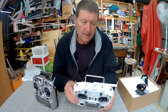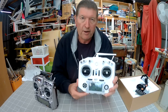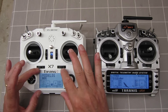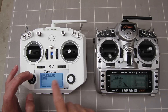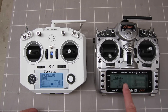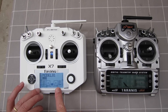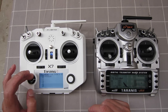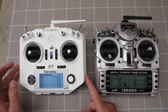You can record your own voice commands and put them on the SD card and assign them to different functions — it's just a ridiculously programmable and versatile radio. Further comparing the two: the Taranis QX7 has a smaller screen but slightly taller than the Taranis Plus, and the font is bigger on the QX7 — they use the screen real estate a lot better. On the Taranis Plus you get a little bitmap image of the model which forces it wider; they've done away with that on the QX7 so you get more information in a smaller area. It comes fully set up with OpenTX 2.2.0.